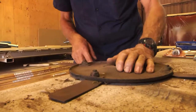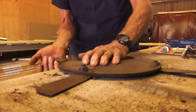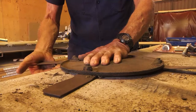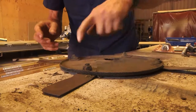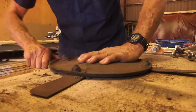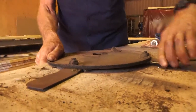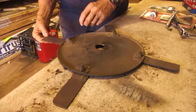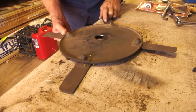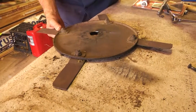See that one's too tight. The reason it's got to swing is when the blades are going around, if they hit something solid like a rock or a bit of pipe, they've got to be able to swing out of the way. Then when it spins up and goes fast, that throws the blades out and they'll automatically straighten out again. They must be loose.